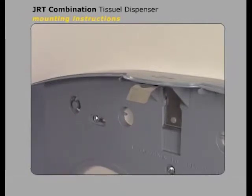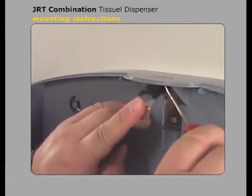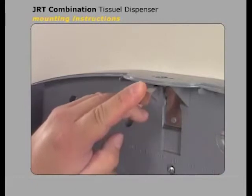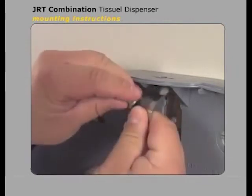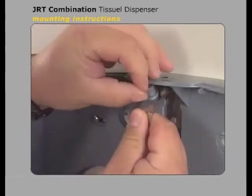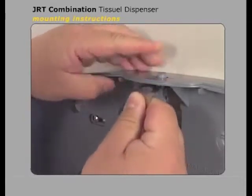To install the push button lock feature, first open the cover, depress the end of the lock spring, and remove the decorative plug by pushing on the tabs of the plug. Be sure not to overstress or bend the spring. Slide the push button under the lock spring and insert the button through the hole in the cover. Release the lock spring back to its original position.